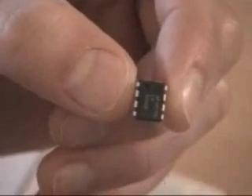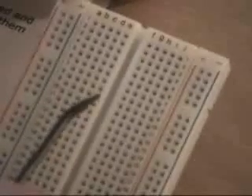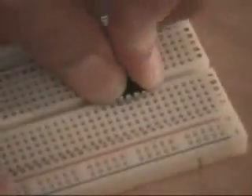Once you've established the top of your CMOS timer, we'll put it into the breadboard. The breadboard, in my instructions, refers to the letters and the numbers. So the 555 timer will go in — pin one is at E8. So E8 is right there; there's E and there's the 8. This top left pin goes there. You need to push this into the breadboard so that the CMOS timer bridges this gap.